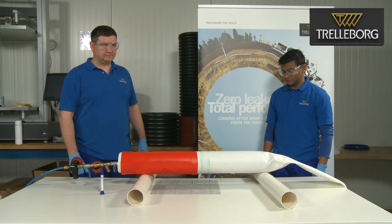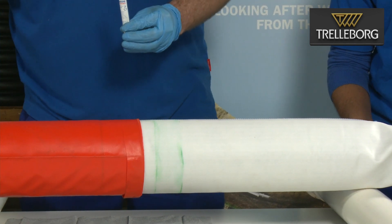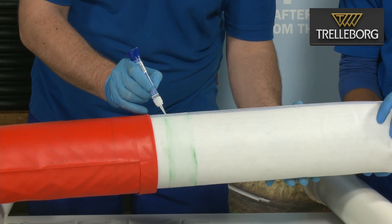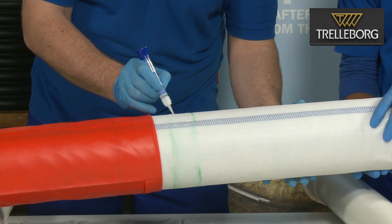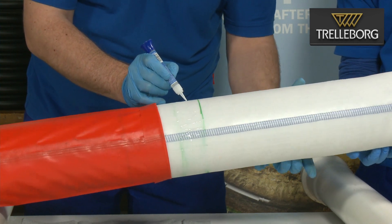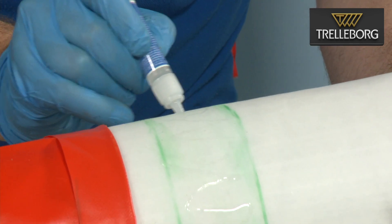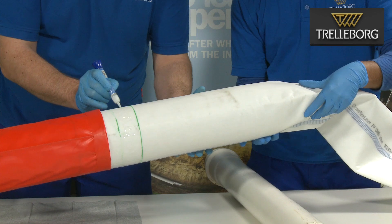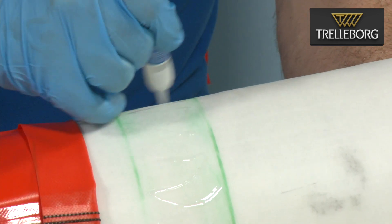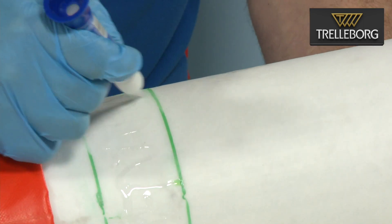The next step is to thoroughly clean the surface using brake cleaner. The end cap and liner are now fully prepared for the next stage which is the gluing. Before using the glue, read the instructions and make yourself aware of any hazard precautions. Apply the end cap liner glue around the entire circumference of the liner in a zigzag pattern as shown. The zigzags should be approximately 2 centimeters wide, keeping within the lines of the 50 and 55 centimeter markings on the liner. The best method is for one operator to rotate the liner and packer whilst the second operator applies the glue.